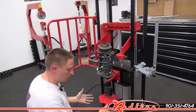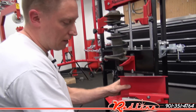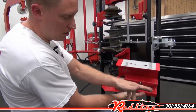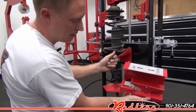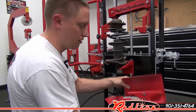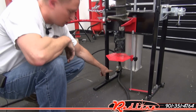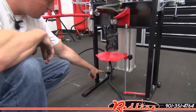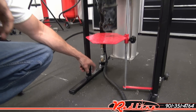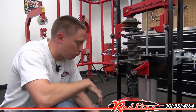Let's talk about some more features of this unit. It's foot operated — you've got an air foot valve here. It's a rocker: release on this side, compress on this side. Nothing to it. It is shielded, so you're not just going to drop something on it and accidentally decompress it. If we look back over here underneath it, we've got a pressure release back inside of here. That's very important because you don't want this thing making more power than it should and causing something to break.